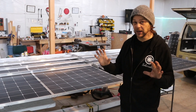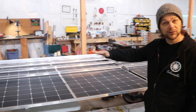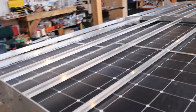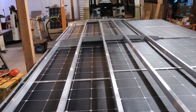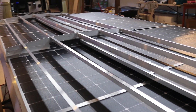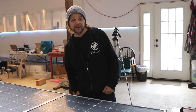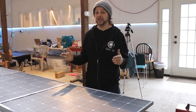We'll get it up on top so we can get our mounts and everything completed. You can see the frame on top — that's where the fixed panels will go. The fixed panels will give a nice curve to shed water, riveted down to the frame and sealed around their edges with a cork rubber, sixteenth-inch, half-inch wide gasket. This is probably the most challenging part of the whole build. What's really special is the solar power and this array — getting basically three times the footprint of the vehicle.